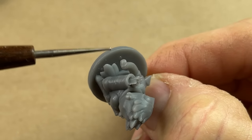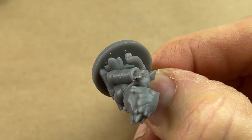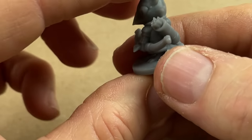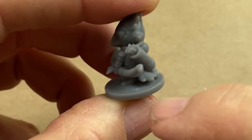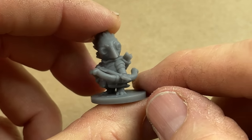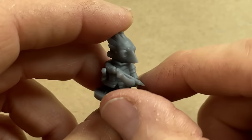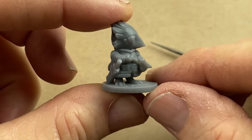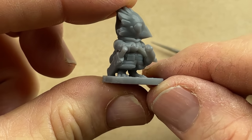Particularly because it's got three lobes — each one of these lobes is a perfect place to catch bubbles. A much better design would have been to attach the tail to the base all the way down, and fill in behind the tail and behind the legs.